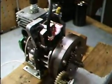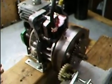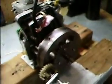If I do this again, I think it would be better to use maybe a small Tecumseh two-stroke from a snowblower. That would have more horsepower and maybe even a little less compression. There's a ratio that I was looking at, horsepower to PSI of compression. I guess this has a pretty high rate of compression for low horsepower. I'm hoping that the Tecumseh engine will have a lower compression but a higher horsepower, just because of displacement. And then I, of course, have to have a bigger flywheel machine for that. So that'll come later. But I will fix this one, just as a test.